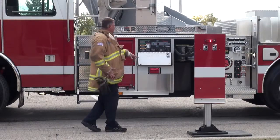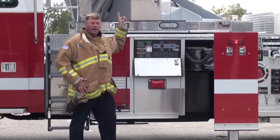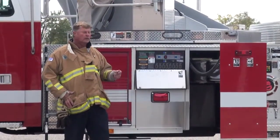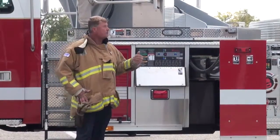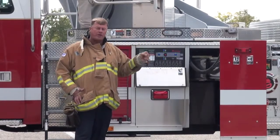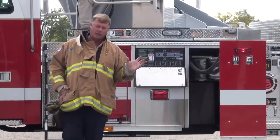On this truck, it's a two-person process. I have to hit the auxiliary power button while the operator's on the control pedestal doing whatever function he wants to do. And there's a correct sequence in doing that. Let's say we want to rotate left. He operates the rotate left before I hit the EPU switch, because if you don't, there's no place for that fluid to go.